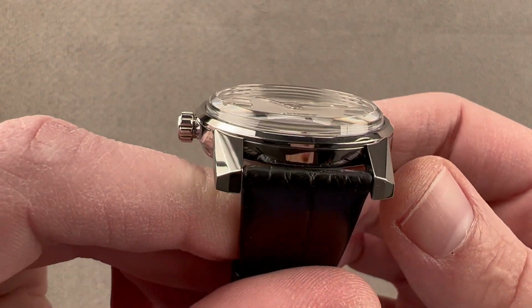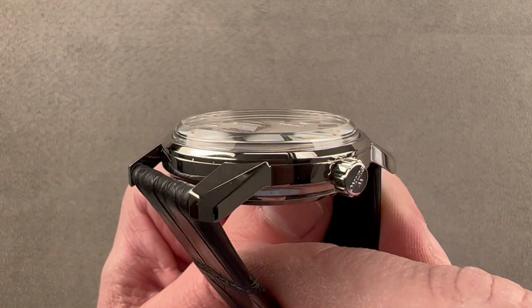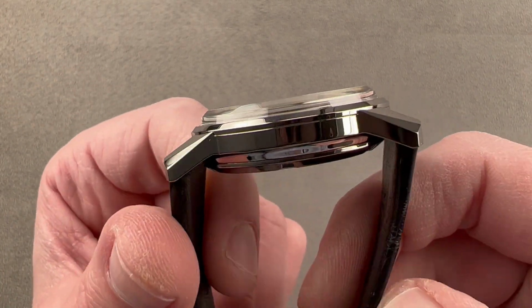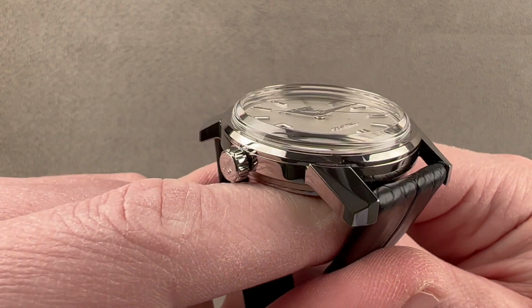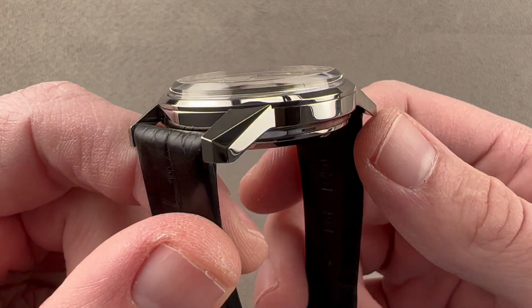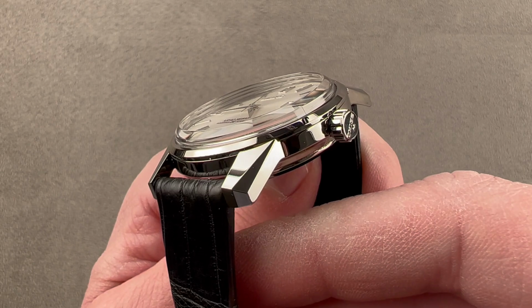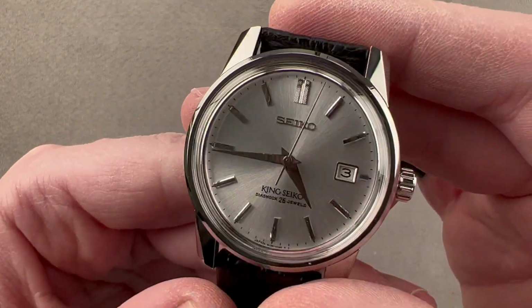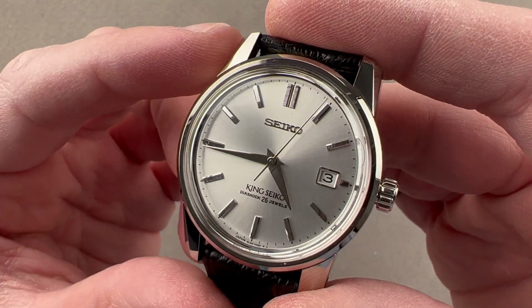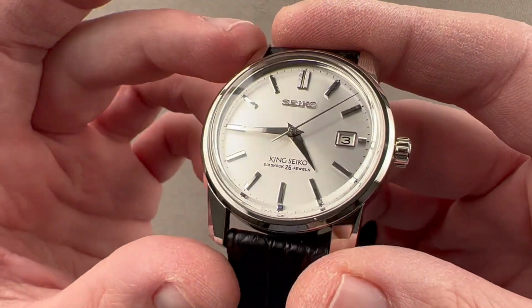You can see Zaratsu polish deployed. This is the tin plate manual polishing method that's practiced at Seiko and Grand Seiko. Essentially the piece to be polished is held directly against a spinning tin plate on a Zaratsu machine. It takes about 3 years to learn this art, but the result is black polish on the exterior of the case. This is a hand-finished case. Typically, to get black polish on a Swiss watch, you're going to find it on very small parts in the movements of very expensive watches. So you've got a handcrafted watch here before you even get into the dial and the movement.